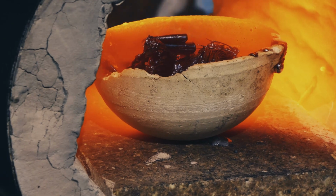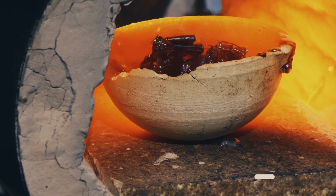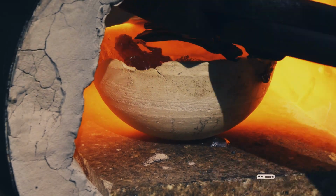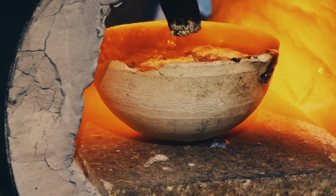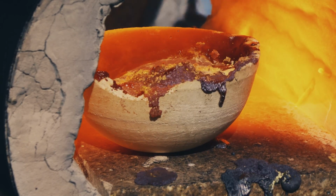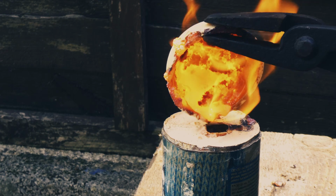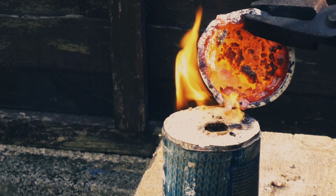I then put the copper and the tin in a crucible with some flux in the forge. Accidentally spilling the metal twice meant there wasn't quite enough to fully fill up the mould. This is why the hammer came out slightly different than the model.